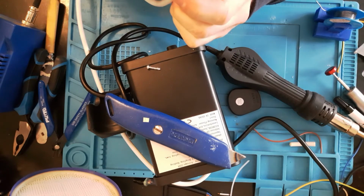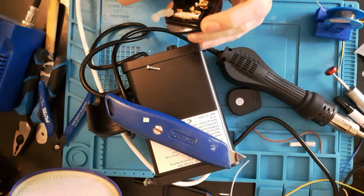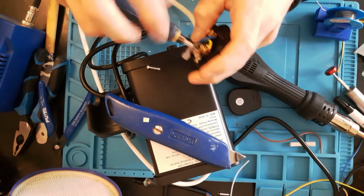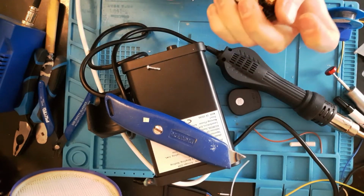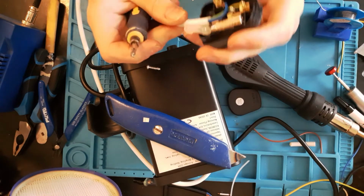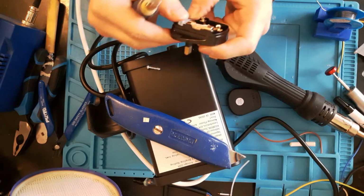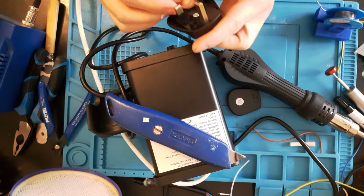Trust the screw. It's not the best plug. It doesn't have the rising clamp terminals, which would be ideal. Then not many plugs do, to be fair. Get that one in there. Screw it on in. Nice. And as you can see, if it gets pulled, the live will be the first one to come out, neutral will be the second, and the earth will be the last one to stay in. Theoretically. It's nice living in a world of theory.